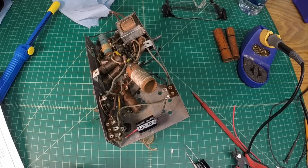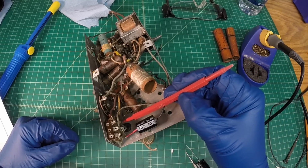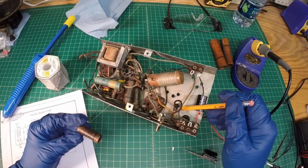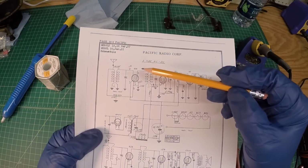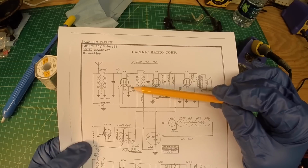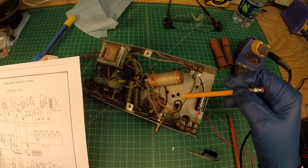Let me go ahead and dress up this second electrolytic capacitor here, which will attach to this terminal here on the negative side and the positive back here, which should head off over to the choke at some point. So we'll look at that in detail. One other thing I'm doing here too, the capacitor here, it's a 0.1 microfarad. It resided here from the chassis ground back over here to the 6D6, and I'll show you where that's at on the schematic. And hopefully this is showing up here, but it's this cap right here, this 0.1 microfarad. And again, it's running from pin 4 and 5 are tied together, which is the grid 3 and the cathode of the 6D6. And then you've got, again, the 0.1 microfarad cap tied back to ground. So that was kind of positioned in here in my way.